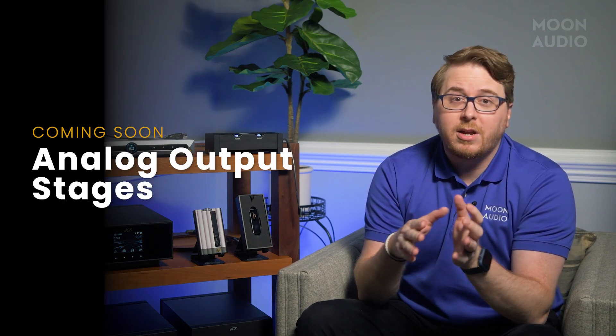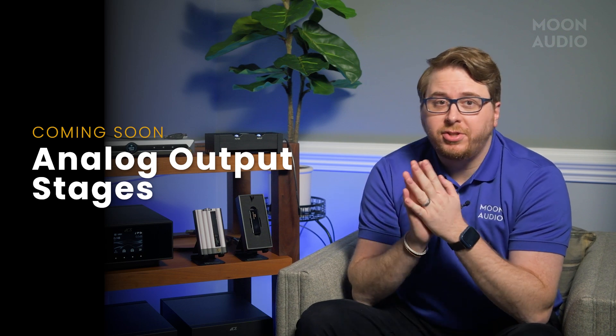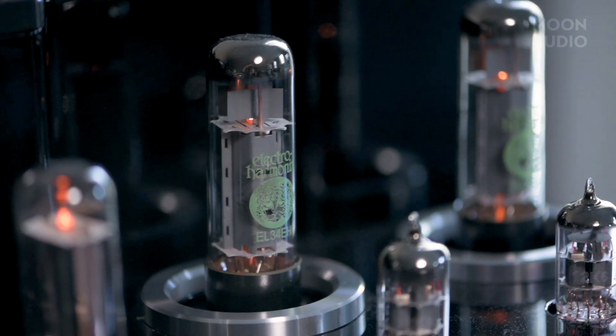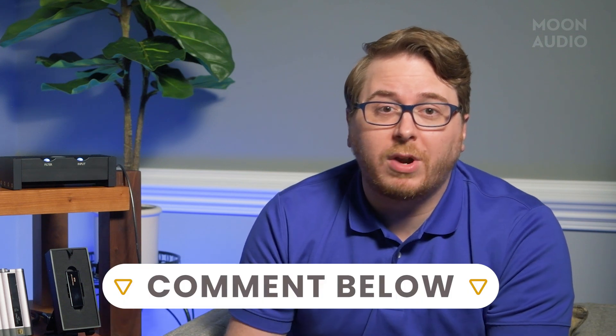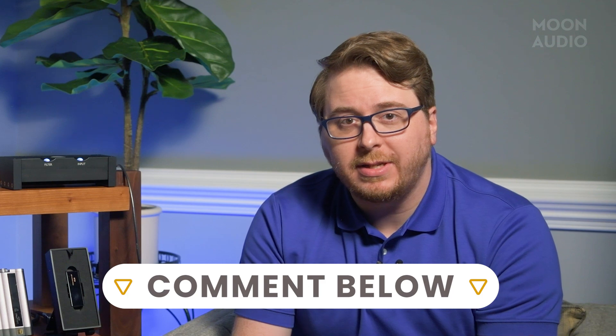One other very important piece of all this that we have not touched on is the topic of the analog output stage that comes after the D-to-A process. This can dramatically change the tonality of the DAC. While we can summarize certain DAC chips to have certain coloration, one thing a lot of folks are not looking at is this output stage. You can have a solid-state output stage or a tube output stage. With tubes, you can dramatically change the sound with a tube roll. And let's not forget about replacing the entire output stage with a high-quality output transformer. We used to do a mod to the brand Origami on their CD players where we used Lundahl output transformers — talk about a transformation in sound. If you want us to cover this or anything else on DACs in another video, drop your questions in the comments below.